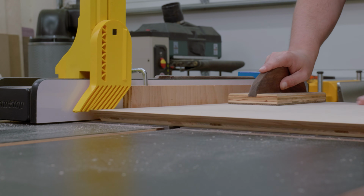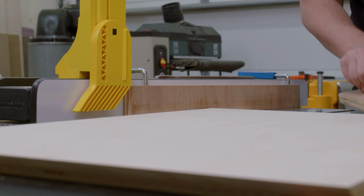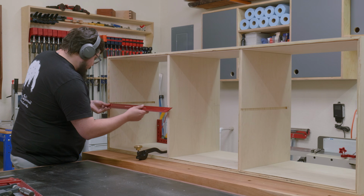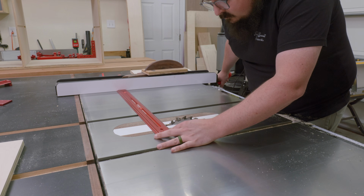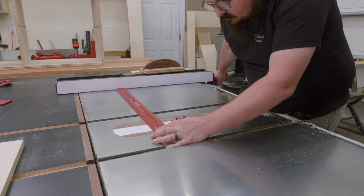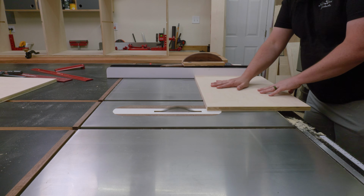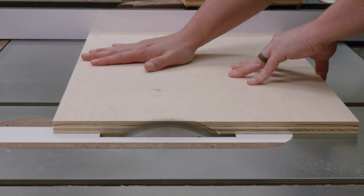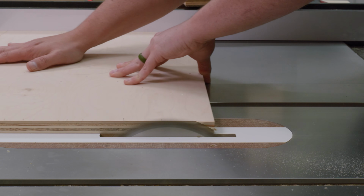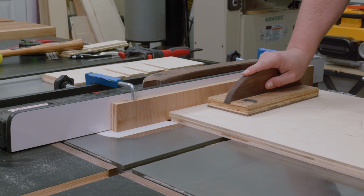Now early on, I talked a little bit about using fixed shelves. And in previous videos, we've talked about why I use shelf pins versus fixed shelves for certain types of furniture. And with this piece, the design really dictates the need for fixed shelves. Because the sideboard is so long and wide, it really needs the fixed shelves to help with the support. The carcass might be okay with just the vertical partitions, but I feel like the fixed shelving is doing a lot for the structure as a whole.